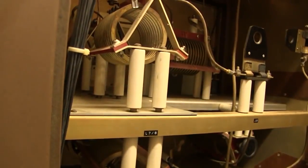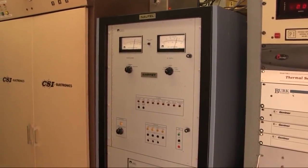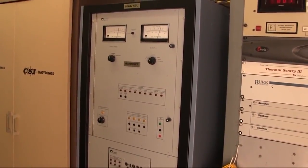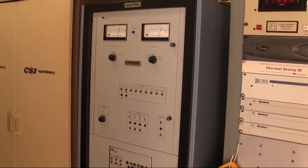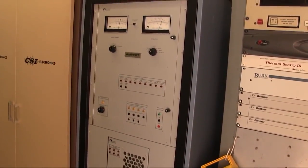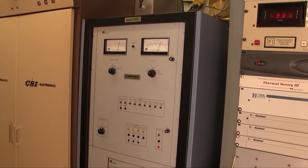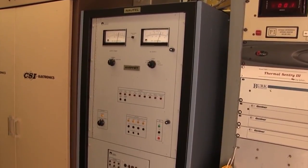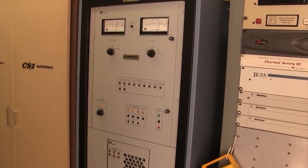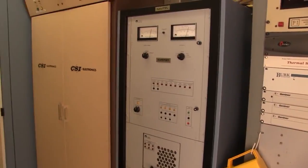And that's what does the directional antenna magic. Now this little blue and black transmitter with the gray front is a 1 kilowatt solid state transmitter. We only run this one at night when we go directional and we have to reduce power. It's fairly quiet and runs fairly cool. And I've really had no trouble with this transmitter since I've been here either.